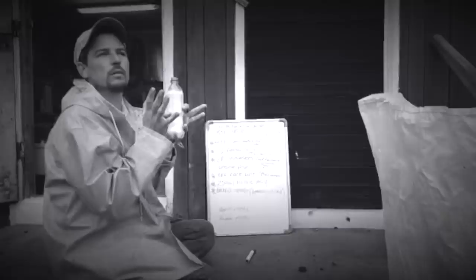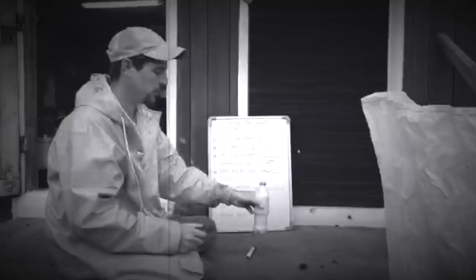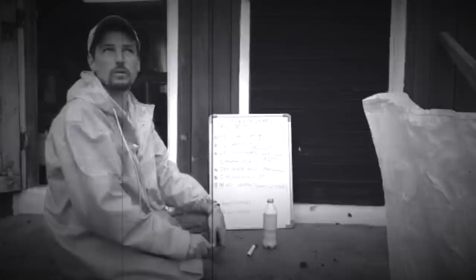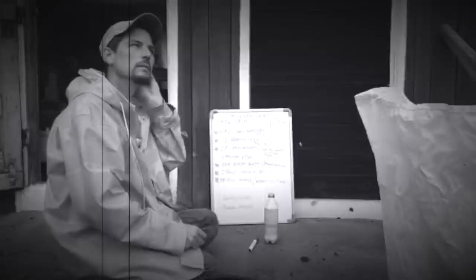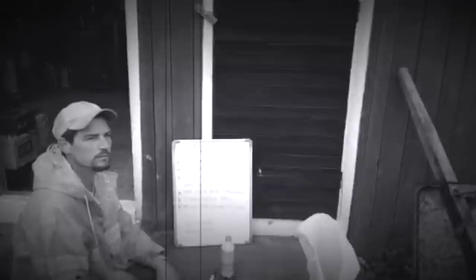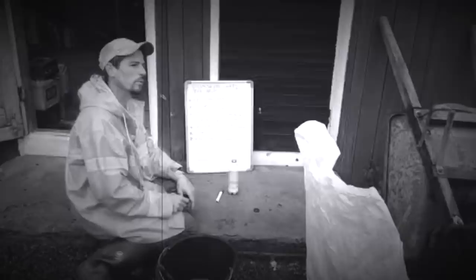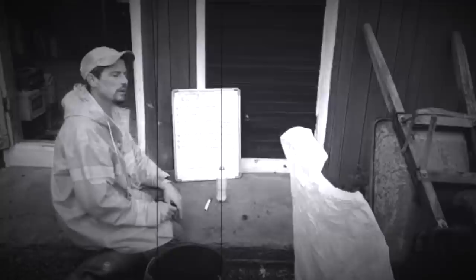This will start bubbling soon. It's a cold day so it'll take a while since we're filling it with water at about four degrees. But if it's sitting out at 20 degrees it will start regularly producing methane and CO2 — just like a cow — because all anaerobic digestions produce methane. As for the cow manure, it shouldn't be full of anything that kills microbes. By default what we're talking about is organic farming.